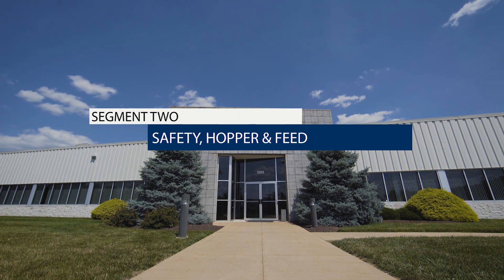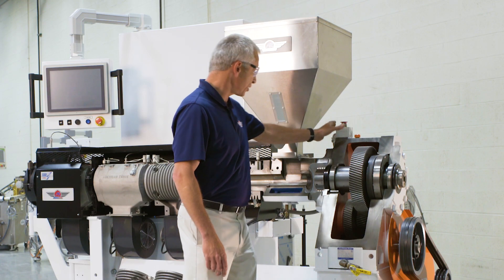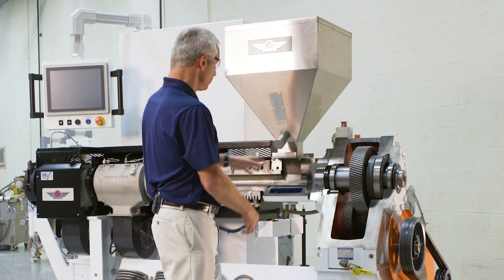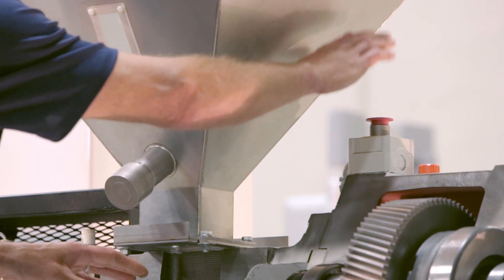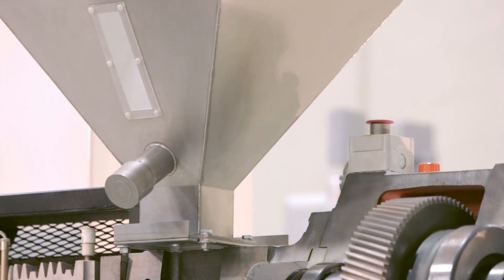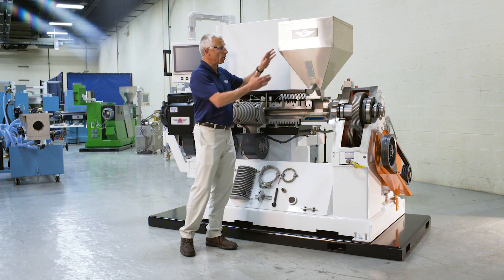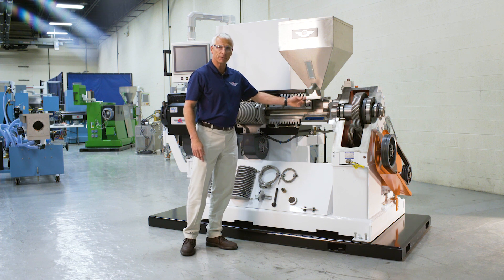In the safety, hopper, and feed section: we have an e-stop located on the top of the box, which is required by law, close to the feed section. In case anybody had the hopper off the machine, it would be very easy to hit that e-stop if they got their hand caught inside the machine. The hopper features a sight glass, a dump chute, and a slide gate shutoff.